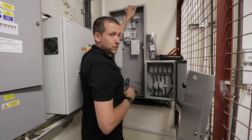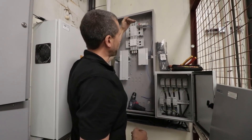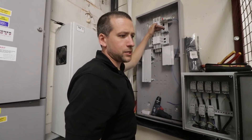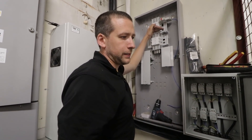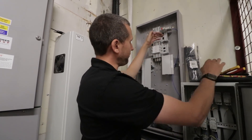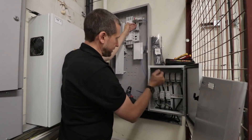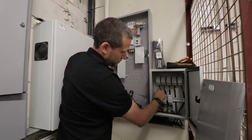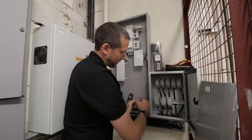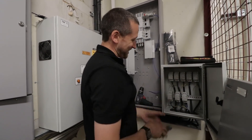I've got a load of RCBOs which haven't turned up yet. This C10 is going to do all the switches — it's just the trigger. I've got a load of RCBOs turning up — B25s, I think. Those are just going to feed out from here. I'll run the feeds in singles to each one of these contactors. You'll have eight RCBOs feeding out to the contactors. That's the plan.